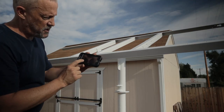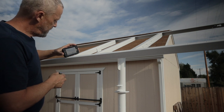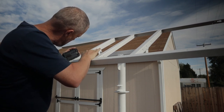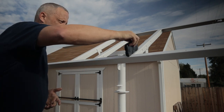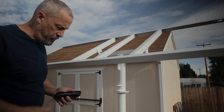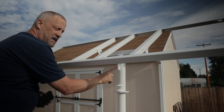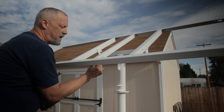I'm simply going to use an app on my iPhone to find the proper angle. For my location at this time of year it's saying 31 degrees, so that's what I'm setting it at. I'll tighten these two bolts down to hold that angle until I can get a bar cut that'll fit from this post mount up to this angle iron bracket here.